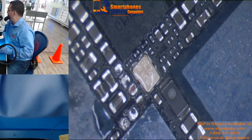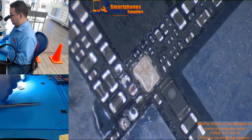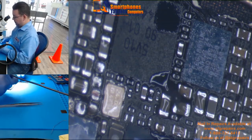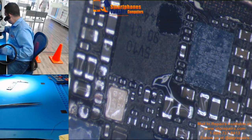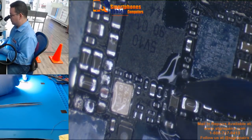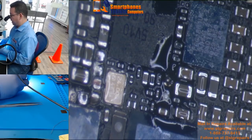There's another way. If you have hot tweezers, you can use those. Depending on the tweezers you have, that will determine how fast it's going to be. If you want to do it with hot tweezers, one way that I do it — which is faster for me — is you put 63/37 solder on both sides. You're just going to touch both sides at the same time. The bigger the component, the more heat you're going to need. As you can see, we have removed that one with no issues.